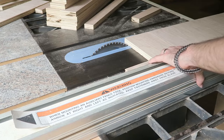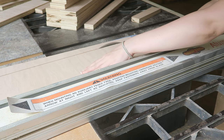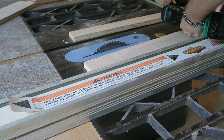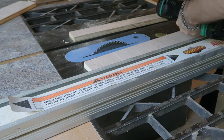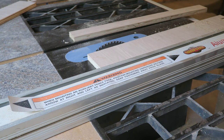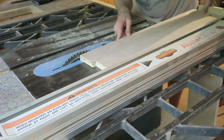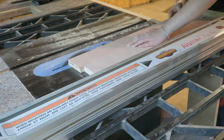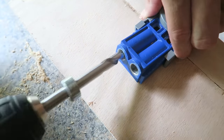If you're using a table saw to make the jig, take a scrap piece of wood and make sure all of its edges are squared off. Place the leg you cut by hand against the table saw fence and place the scrap wood against it, then cut off the long edge of the scrap wood. Attach the wider end of the scrap wood to a small block to give you something to push the leg through. Make sure the small block is even with the square side of the wood and sticks out on the side that's angled so it can help you push the leg through. Then line the jig and fence up so that the blade hits the leg at the place you want to start your taper, and then use the jig to push the leg through.